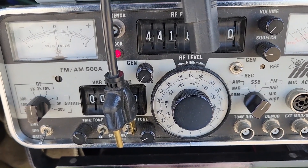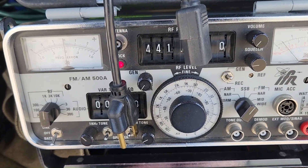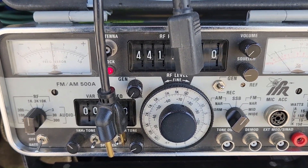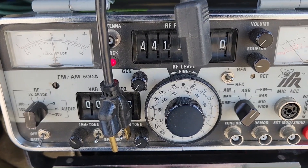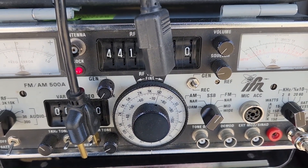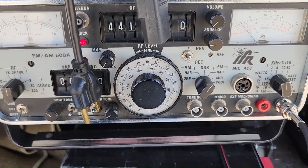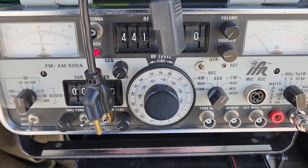So I'm going to go into this system and start first with an ISO-T at the receiver — some of you may be familiar with that test — and put a load on each component in the antenna system until we can find where that desensitization stops, all the way up to the antenna if needed. That would take a tower rigger to go up, disconnect the antenna, and put a load at the end of the feed line. If desens is still present there, we know it's in the feed line system — the cabling between the transmitter and the isolator, the isolator and the duplexer, possibly a filter in the receiver, or the feed line between the duplexer and the antenna, or the antenna itself.